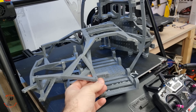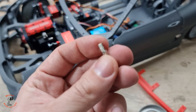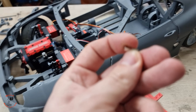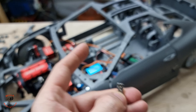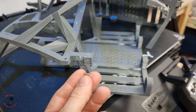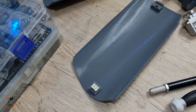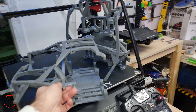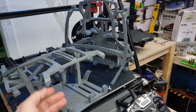There will be a magnet here and it will hold the door. For the door magnet I'm using these cube magnets — they are 3x3mm. For each door you will need six magnets: six like this on the chassis with glue or hot glue, and six on the door. These two chassis pieces didn't print flat — I had to print them at an angle and there were so many supports to clean.